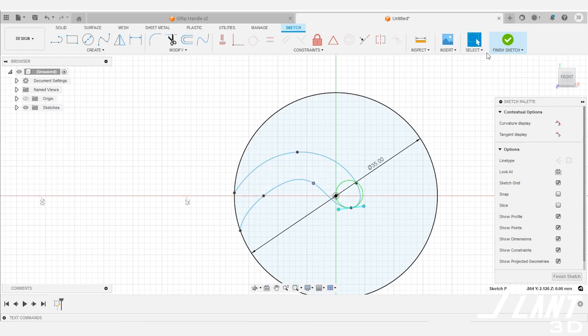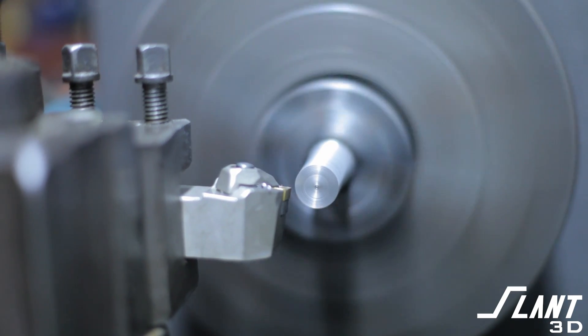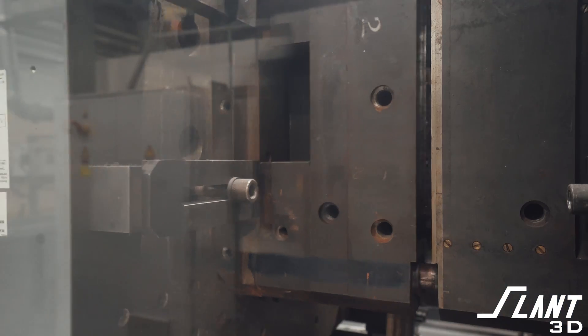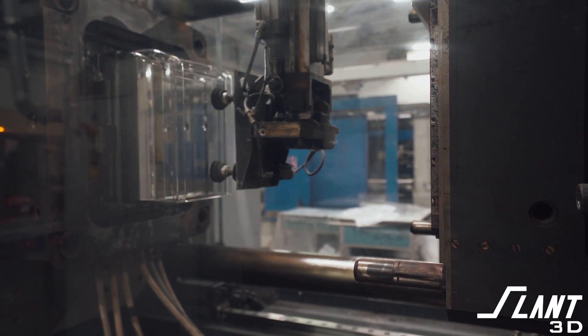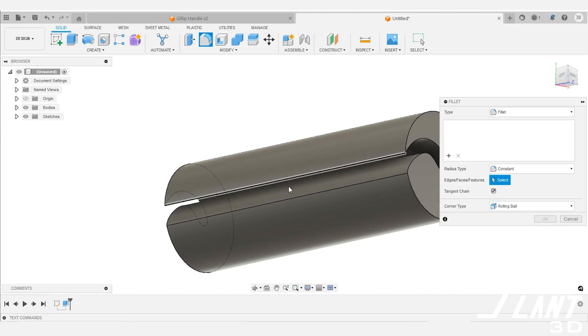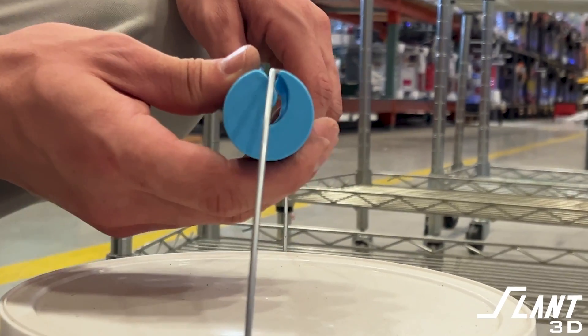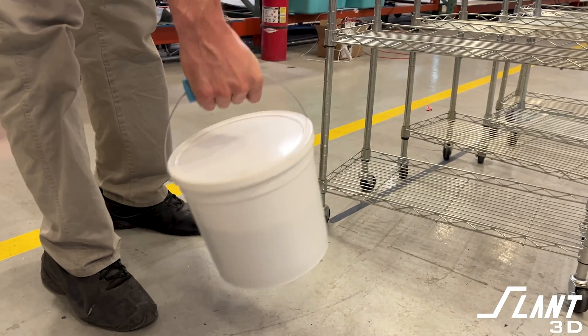While this is a trivial part — a cylinder with a curved slot through the middle — it is actually very difficult to manufacture traditionally because you would have to have a large brick of material that would be carved away. Or if you were molding it, you actually couldn't, because it's so thick that you would have shrinkage and deformation of the surface. But since this part is 3D printed, the interior is basically hollow, so there's not that much material being used. You're still able to create a complex inner shape with that curve so you can put the top of a bucket into it and not worry about it popping out.